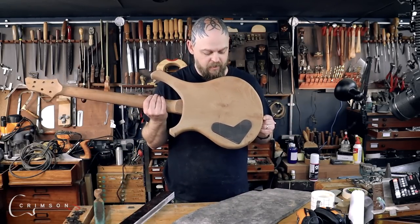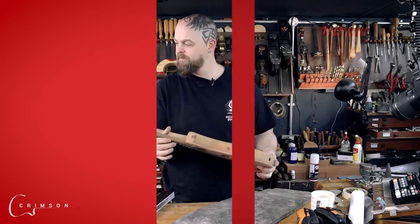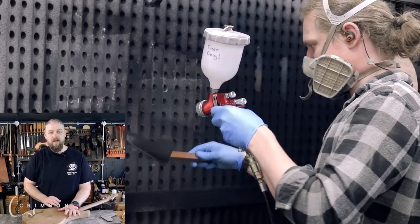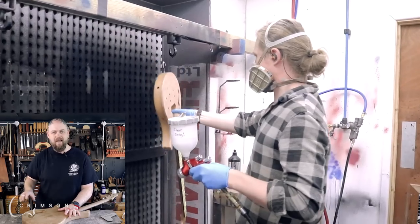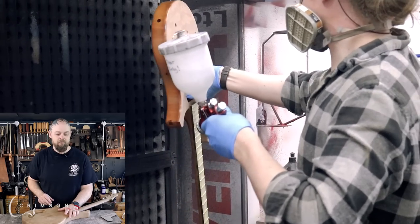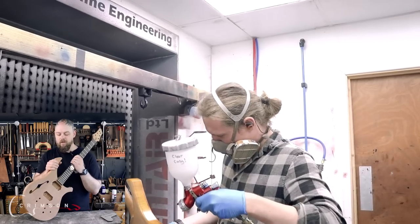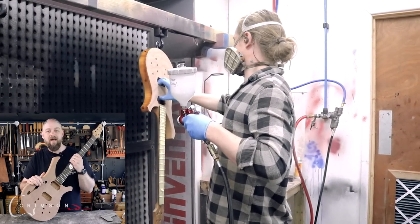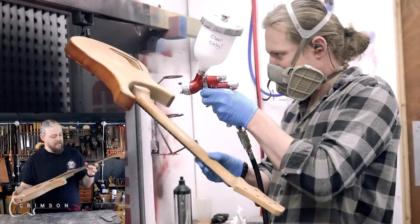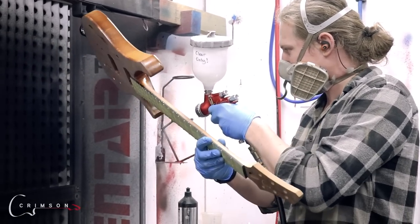Generally you want to leave a relatively meaty gap — you don't want the back plate to expand and irrevocably become wedged in place. Let's go and put that through a sand thicknesser, get into the spray booth. With all of that done it is time to go to headquarters where I'm probably going to delegate the sanding to somebody else. Then we're going to go into the spray booth and I'll hit it with a two-pack flash coat that will allow me relatively rapidly to get back onto the build.